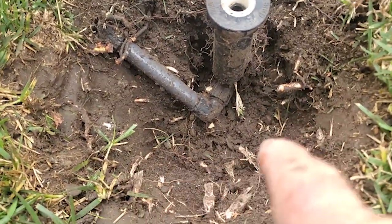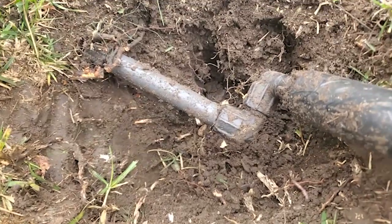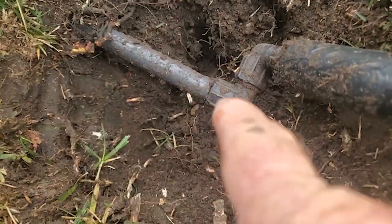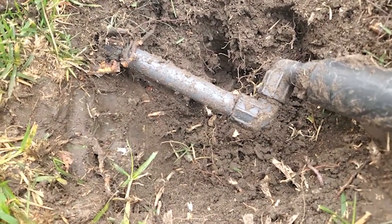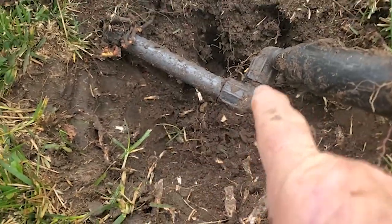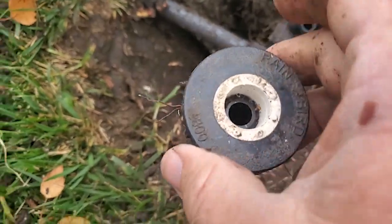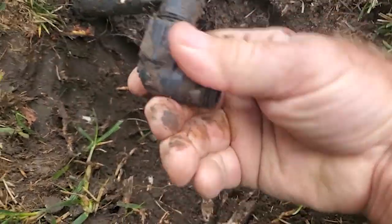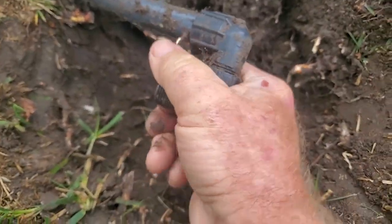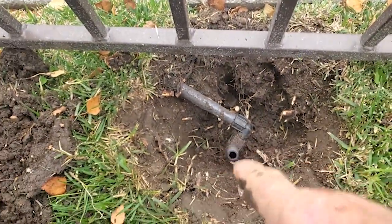I kind of lucked out after cutting through all the roots and rocks and getting this thing loosened up. This is actually on an old-fashioned swing arm from back in the 80s — that's the way we made swing arms. We didn't have flex pipe at the time, so we used schedule 80 risers and Marlex 90s. I'm going to take this off and replace it with a new Hunter pop-up, swing it back around to this side, tighten things up a little bit, set the new pop-up down on this side of the fence, and put it all back together.